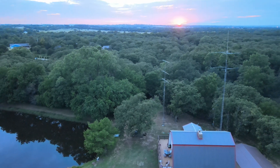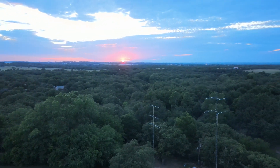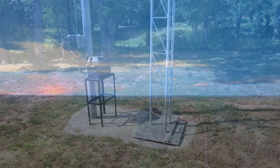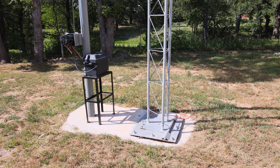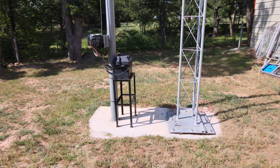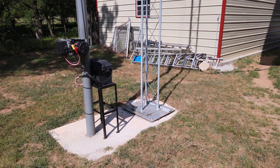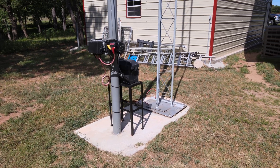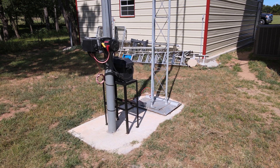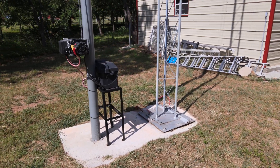The tallest tower is for FM — two meter FM only. Here's the base of it: it's a homemade hinge plate, and it's got a battery set up there that operates a 12,000-pound winch that lowers the tower up and down all in one motion. It cranks it down and up pretty easily, works real good. I went with the 12,000-pound winch just to make sure the braking system was good on it.